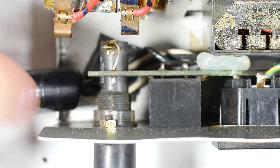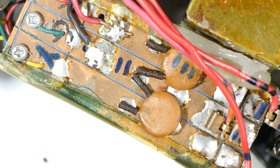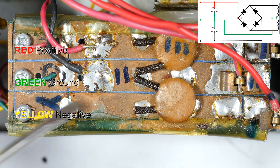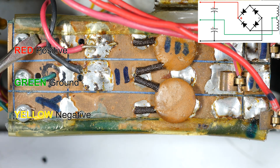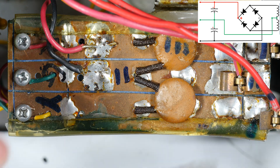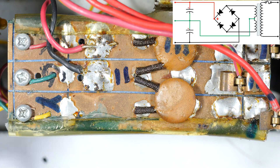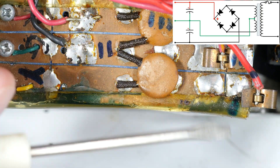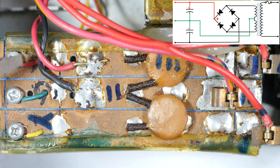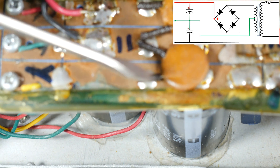This is the ferrite bead that takes the noise out of the system. Moving around the corner, this is basically a bus — three wires running along, marked yellow, green, and red. These are just noise capacitors to take some of it out of the bus. The wires coming in are from the transformer; they come in on this side and go down the bus, and the capacitors are soldered across the bus at multiple points, just like these filter capacitors.